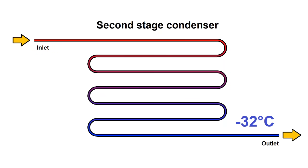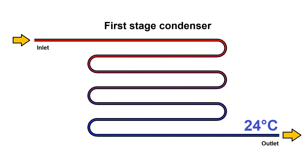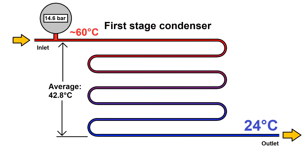So the problem probably isn't the heat exchanger. There are actually two issues here. For one, the average temperature of the refrigerant on the high pressure side is much higher than the temperature where it comes out of the heat exchanger. For example, the intercooler outlet temperature was minus 32C, but the propane pressure was 75 psi or 6.1 bar — and 6.1 bar corresponds to a temperature of 8.5C, not minus 32C. Similarly, in the first stage, the condenser outlet temperature is basically ambient at about 24C, but the pressure is around 200 psi or 14.6 bar, which corresponds to a temperature of about 43C, not 24C. The cause of this is that the pressure needed for condensation is a function of the average temperature throughout the high side. The inlet temperature of the first stage condenser could be as high as 60 or 70C, causing the average temperature to be significantly higher than ambient, even if the outlet is ambient.